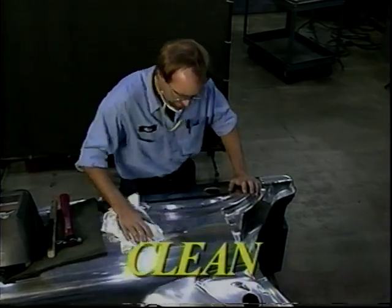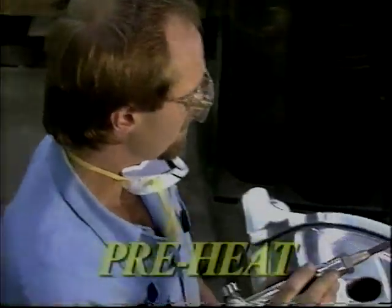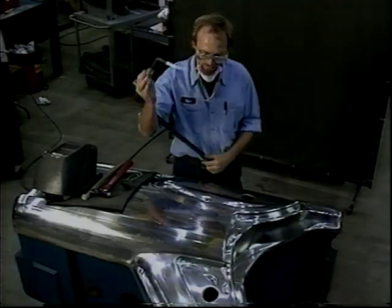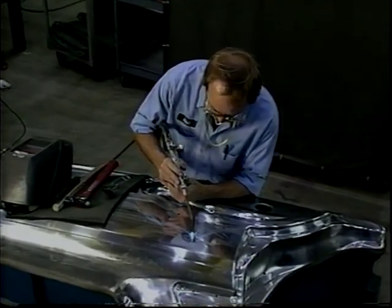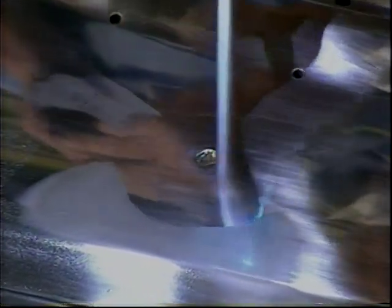It is essential to clean the area about to be welded to remove any rust or oil. Evenly preheat the damaged area only, using a torch in a circular motion. Heat the surface to 400 degrees — up to 500 degrees is allowed. Continue to keep the damaged surface reasonably warm, as large die pieces draw the localized heat away quickly. Frequent preheating will boil out oils and lubes that have become absorbed into the casting pores. Be sure to wipe the oils away as you go along, because they can cause poor adhesion, increased porosity, and pinholes.